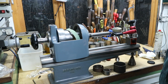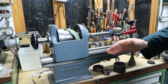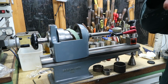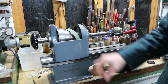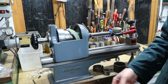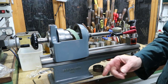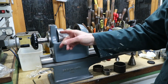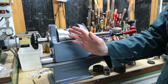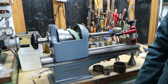I don't see why there's any reason why you shouldn't interpose a gasket or a shim into that gap to shim back or forth in either respect. If you were to assemble this up and find that you have excessive end float - where the inner part of the cover was not pressing on the outer of the bearing sufficiently - there's no reason why you shouldn't make up a shim or spacer to go in there. There's also no reason why you shouldn't adjust the thickness of the spacer between the two bearings on the spindle; it would have exactly the same effect, simply moving the bearings one way or another inside the housing.